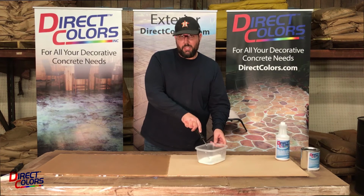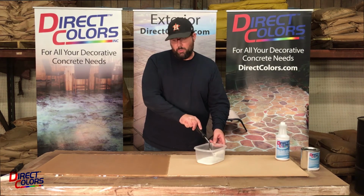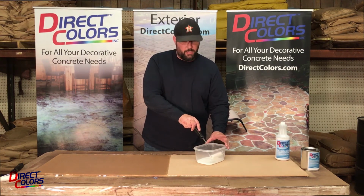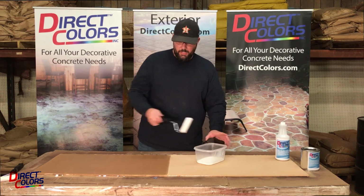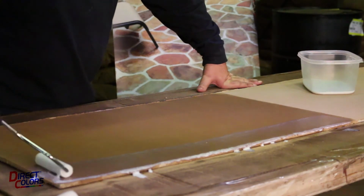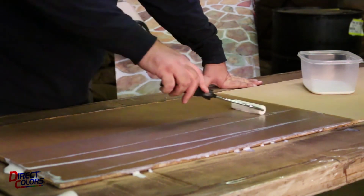I think this is soaked in enough on the overlay. On an actual floor that is not a concrete overlay, it's going to take it a little bit longer than what you're seeing right here. I'm going to go ahead and put this second coat down real quick. And again, like I mentioned, we're going to go east-west. It's a very simple process.